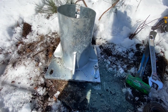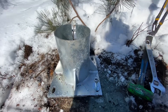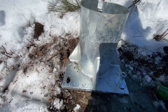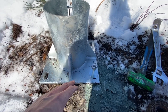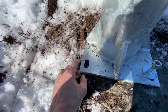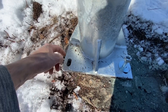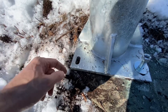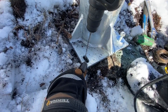Now that I've got my base set, I'm going to grab my level — by eye I can see it's pretty level — and proceed to drill with my quarter-inch bit the pilot holes so that I can remove the base and drill the full holes. These are three-quarter-inch slots, so we have a little bit of play since we're using a five-eighths drill. We want to be careful with the bit going directly through the opening so we don't catch or damage it, keeping the pilot bit approximately in the center of our slot.